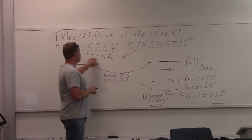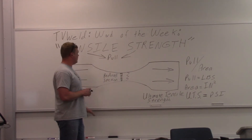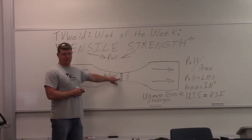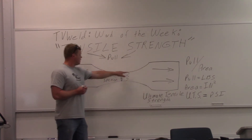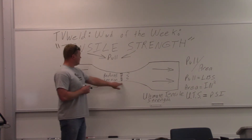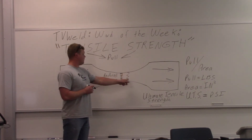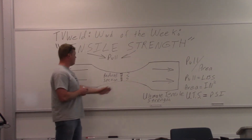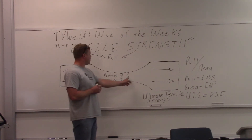Tensile strength is what you get from doing a tensile pull. A typical tensile pull specimen — this little scalloped line right here in the middle is where the weld would be. So if they're doing weld recertification through a tensile pull, they're going to reduce this section down, and the exact dimensions will be right in the code book. The weld is going to be right in the middle. Now this other little crack I drew right here is where that tensile pull should break — right in the heat affected zone. It should never break right down in the middle of the weld, because that usually means something's wrong with the weld and it's an automatic failure. So you want the tensile pull to break right here.